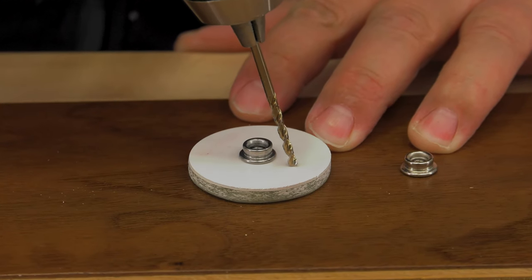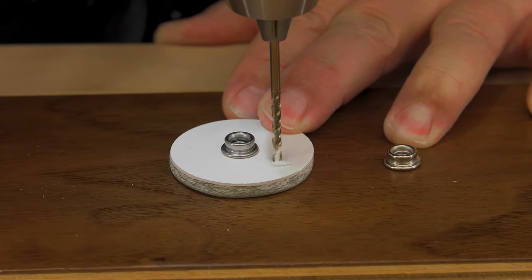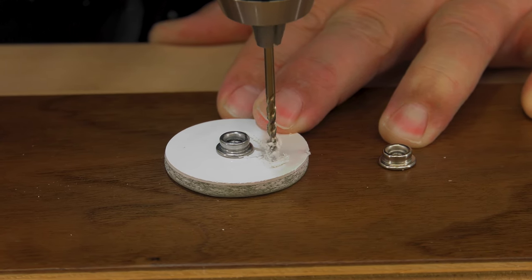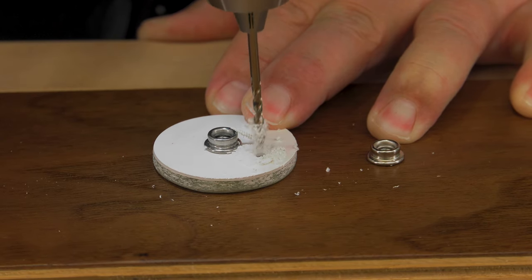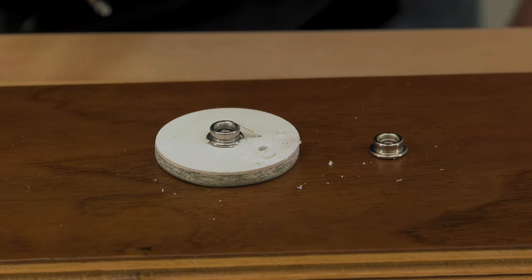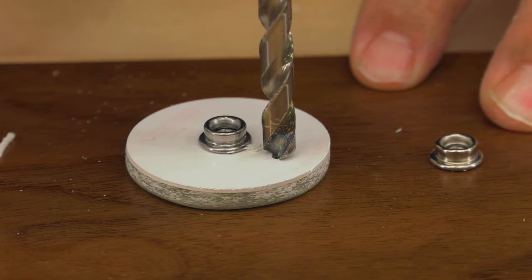Here we have a small sample of fiberglass. A 1/8 inch drill bit is used here. In the fiberglass, the hole must be as deep as the length of the screw that will be inserted. To help prevent surface or spider cracks, countersink the hole slightly.